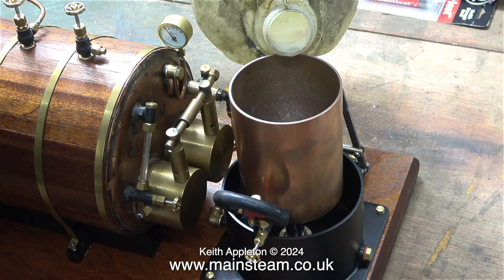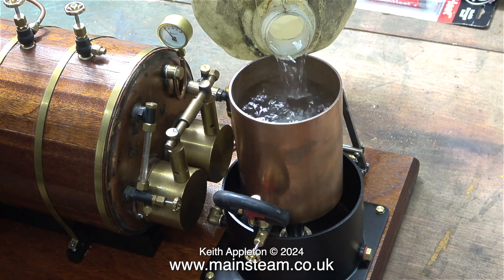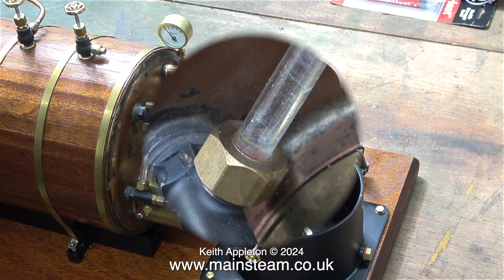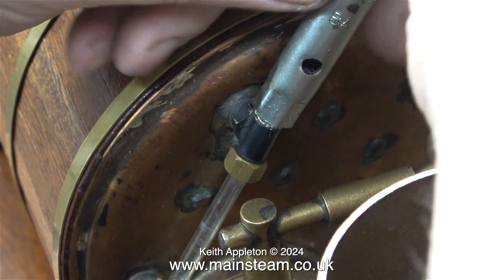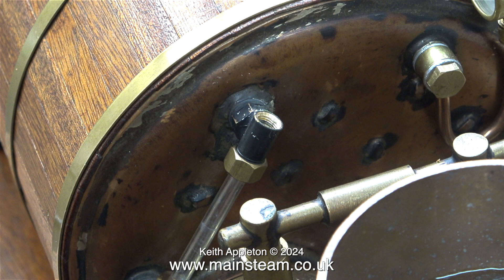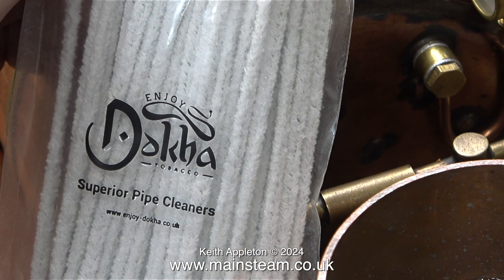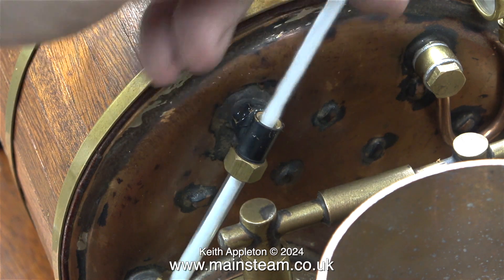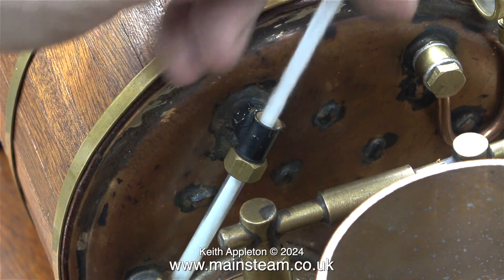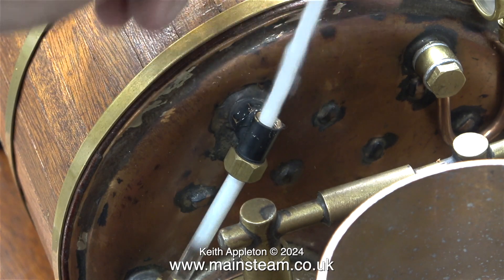The tank in the outer part of the workshop is still very hot, far too hot to handle. So I'm going to pump some water into the boiler. It took quite a while with this hand pump before any water appeared in the water gauge. At this stage I noticed that the water gauge glass was a bit dirty, so I'm going to clean it. I use the box key to remove the top nut, and all I need to do now is use one of these — as it says on the pack, they are superior pipe cleaners. I just remove them from the pack and use one to clean the water gauge glass; it soon picks up some water and makes a really good job of cleaning the inside of the glass.